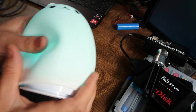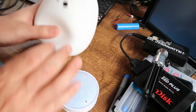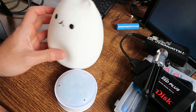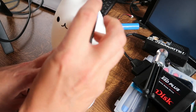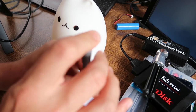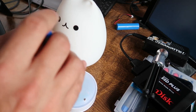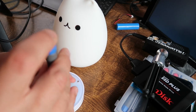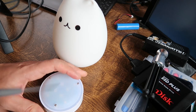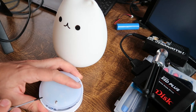Here's our little cat lamp — I'm going to take it apart. It's a really simple device; it's actually got a little controller inside, and I'm sure there's a more sophisticated way of hacking it — connecting the ESP32 over serial and sending data to change the RGB LED colors — but I tried it and it's a bit tricky. I realized it's far easier to just tap directly into the LEDs themselves.